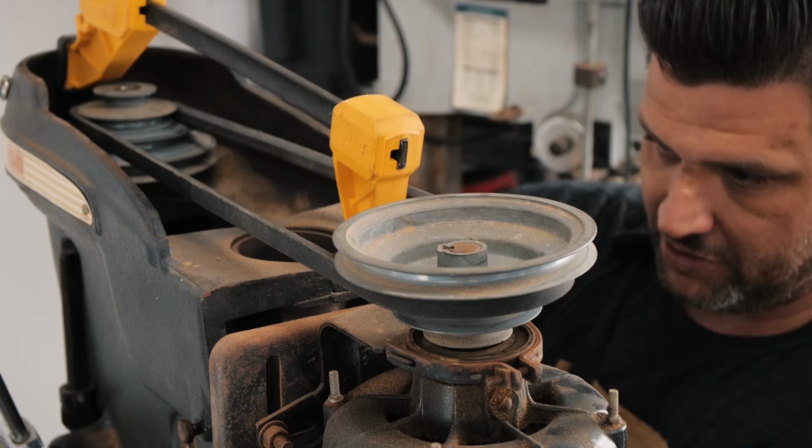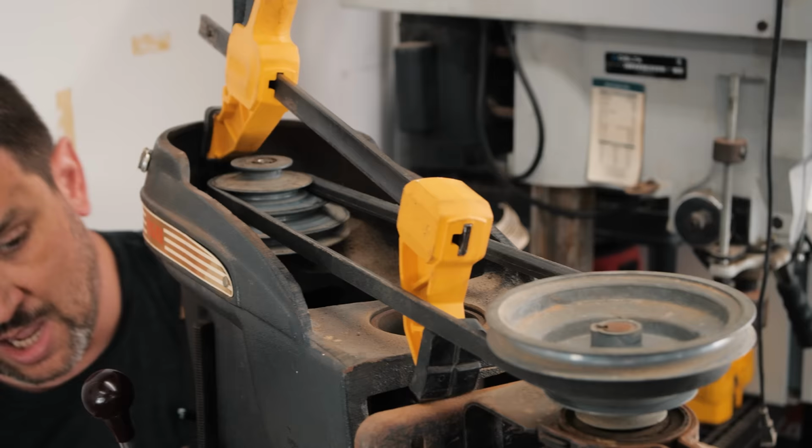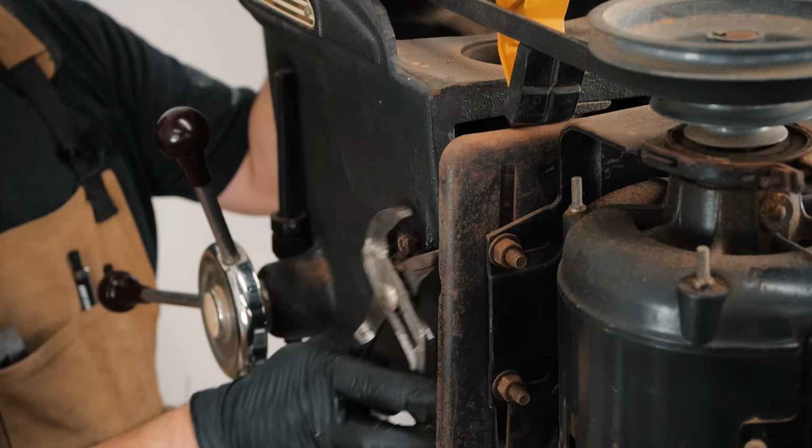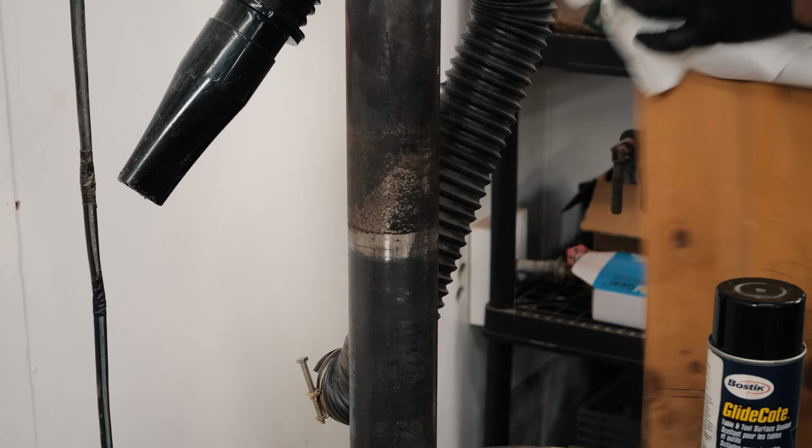And I don't have the user manual. There was a lot of stuff online about it, but no really good maintenance guide or info on taking the chuck off. That was kind of interesting. I'm really glad I did this. So this finishes up all the mechanical things we need to do. And next we're gonna work on making sure there's no run out in the quill and that the table is square to the chuck. Jiminy.